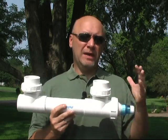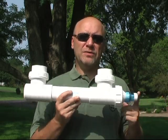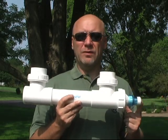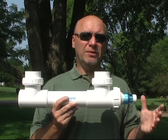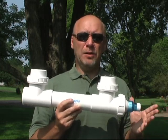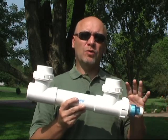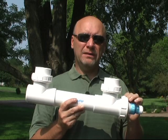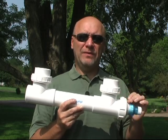If you have UV installed and you're not getting good results, there are a couple of things to check. The first is the life of the bulb. If the bulb is still working but it's over 12 months old in continuous use, there's a good chance it could be depleted or running down. You may want to replace it and see if that helps. The other thing you can do is try to slow the flow rate down through the filter. If the water is passing through this system too quickly, the UV may not have enough time to affect the algae.